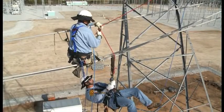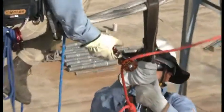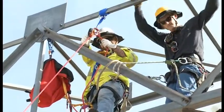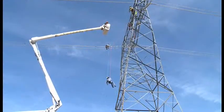We have to bring him out from the transverse face of that tower, beyond it, and then put a directional on the conductor up there as a redirect so that we can direct it and lower him down from a position further out from the tower. That way he's not going to be in harm's way.